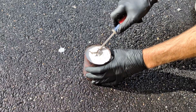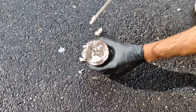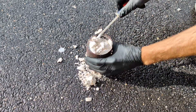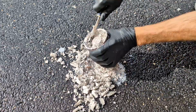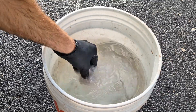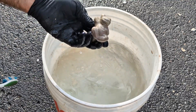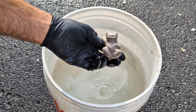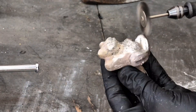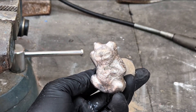I'm going to be removing the pewter from the mold, and this is where I can tell that I didn't really give the plaster a proper burnout, because it's still kind of wet. There is a burnout process that needs to take about 24 hours to complete. I'm brushing off any of the existing plaster with water and a toothbrush to clean it up, and then once dried I'll do more cleaning up with a wire wheel using my Dremel tool.